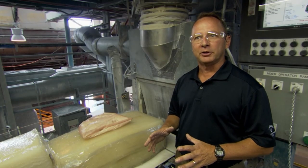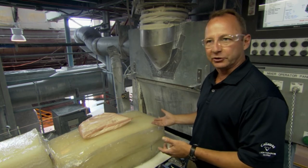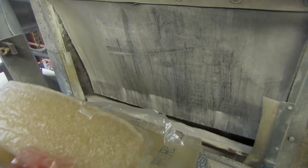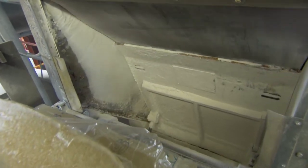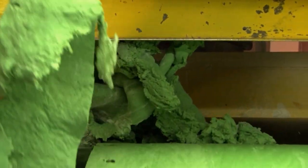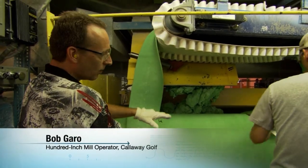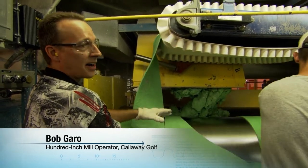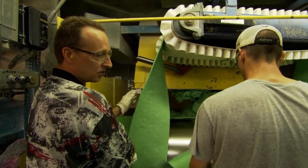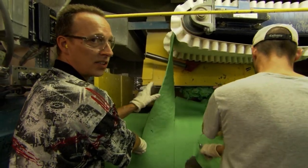When the recipe is all fully put together, we'll bring the charge up to the internal mixer. We'll cross-blend and masticate the product to make sure that all of the fillers and polymers break down and fully mix. Once mixed, the hot rubber is discharged onto the mill. The rubber comes down hot, so it warms up the rollers, and we need water to keep these rollers nice and cool. If they get too hot, this stuff runs bad.